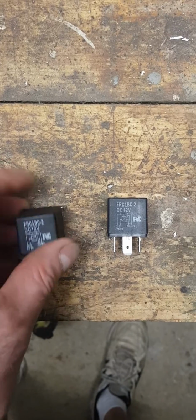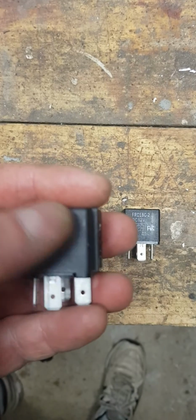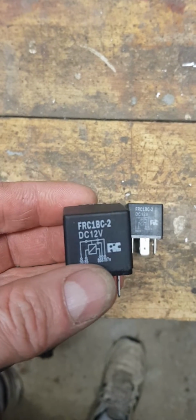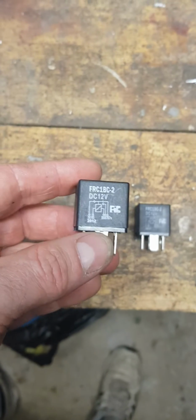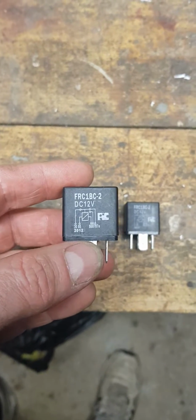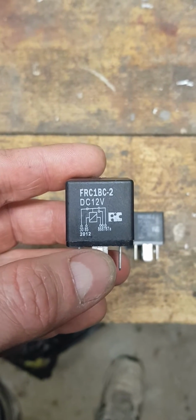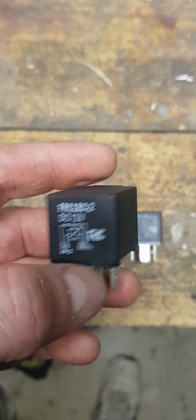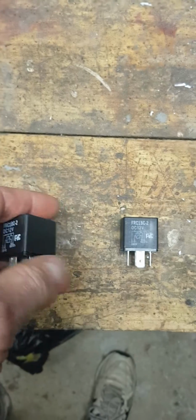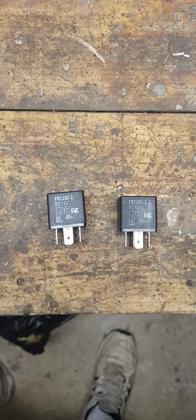It's usually these relays that, after a long period of time, the terminals inside them get worn out, pitted, and eventually they start playing up and stop working. These are just $6.95 replacements from Jaycar. They're 30 amp single pole double throw, as you can see here from the diagram, and $6.95 compared to $75 for a pair on eBay, the original Johnson relays.